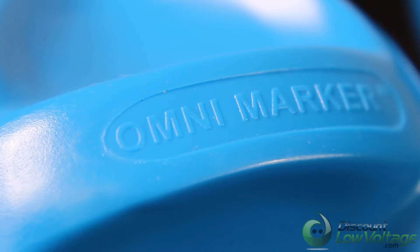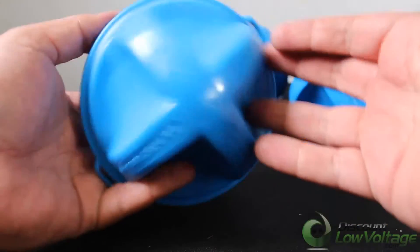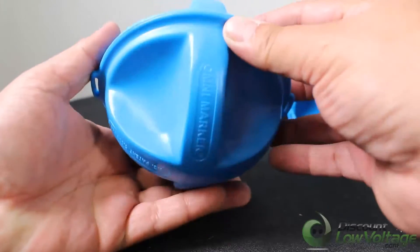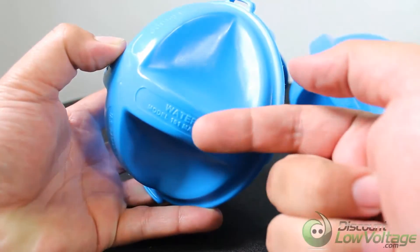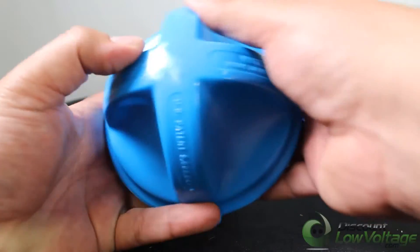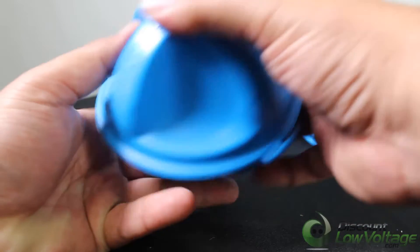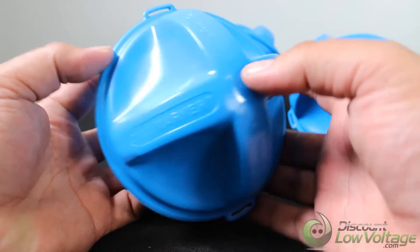Lightweight with no hazardous chemicals, the Omni marker contains no batteries or active components, meaning these markers will last as long as your buried plant. OSP cable life expectancy is around 30 years, so it should last you a long time. These Omni markers use industry-standard frequency, so they'll work with any electronic marker locating devices.